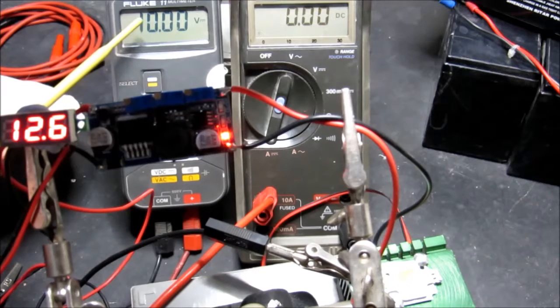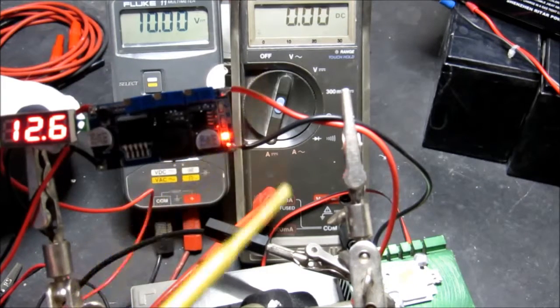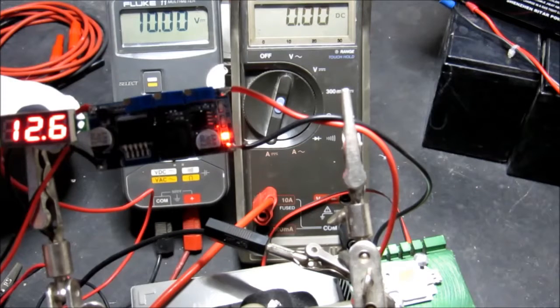On the meter here we'll set the output voltage — at the moment it's set for 10 volts, measuring across the outputs. We'll use the current meter to set the short circuit current, which is the maximum current for the LED of 900mA.